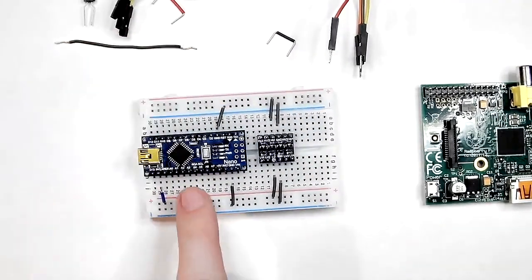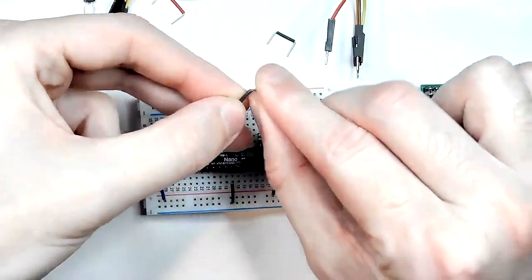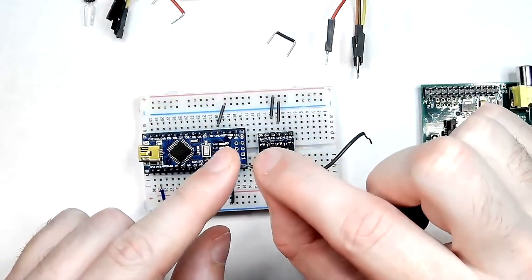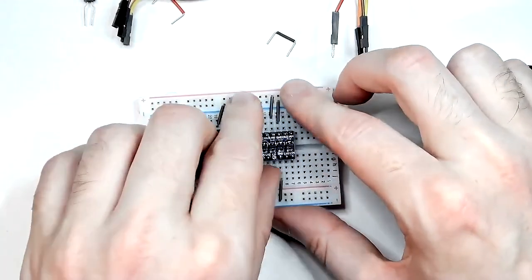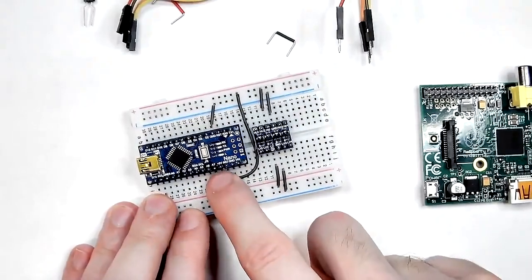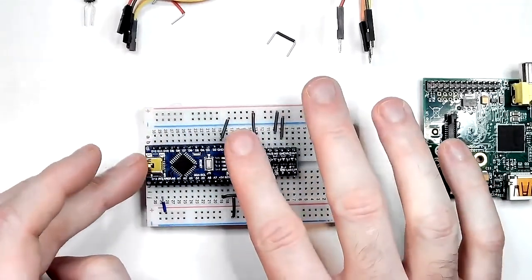The LV, which is the low voltage pin on the level shifter, gets connected to the 3.3V red rail down here. Finally, because we're going to bring 5 volts into the board, we need to connect to the 5V pin on the Arduino Nano. Take the longer grey jumper, bend it into a J-shape, connect one end into the 5V rail and the other into the 5V plus pin on the Nano. This will power the Arduino Nano — if you don't get this right, you won't get power to the Nano.